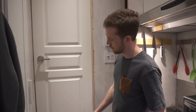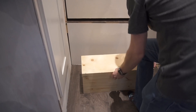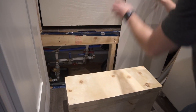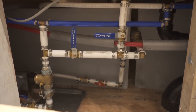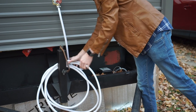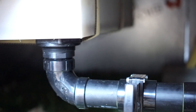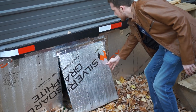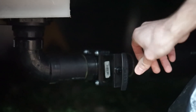This is the bathroom. It's on a raised floor and there are water tanks underneath that store 88 gallons of water. The tanks are back in there along with my pipes and booster pump to give me water pressure. I moved in about three weeks ago, and last week the park water was turned off for winter so the pipes don't freeze — I filled up my tanks then and after four days I still have more than half left. All drainage from the shower and sinks is piped down to a gray water tank strapped to the underbelly of the trailer. There's a valve to drain it down to the septic system in winter, and in summer I just keep it open to drain all the way through.